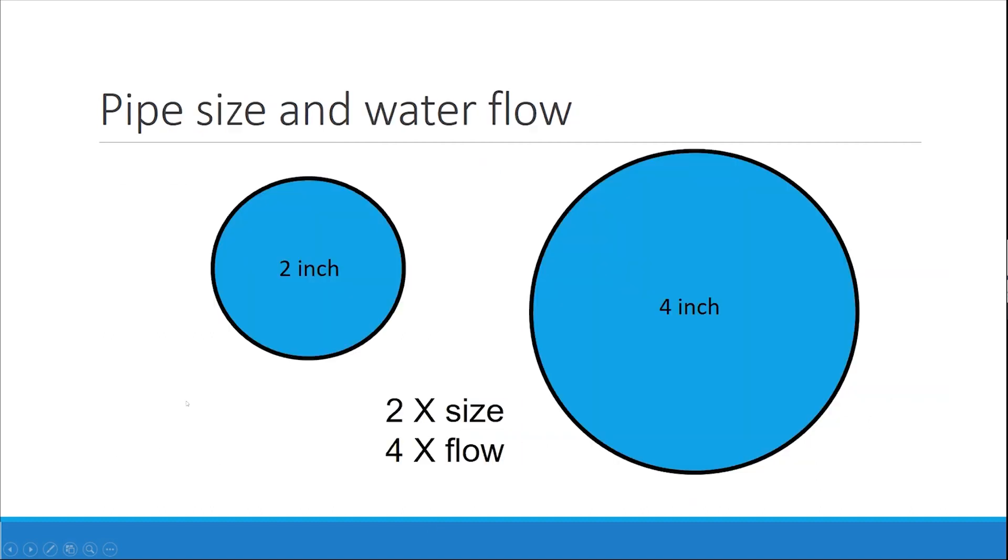This is something that wasn't terribly intuitive when I was learning about it. We think of a garden hose and how much pressure comes out. But actually, the wider the diameter of the pipe, the better the flow and the better the pressure. You want to restrict things as little as possible up until you get to your laterals, because each time you downsize pipe size or there's a bend or an elbow, you're going to lose pressure and water flow will be reduced.